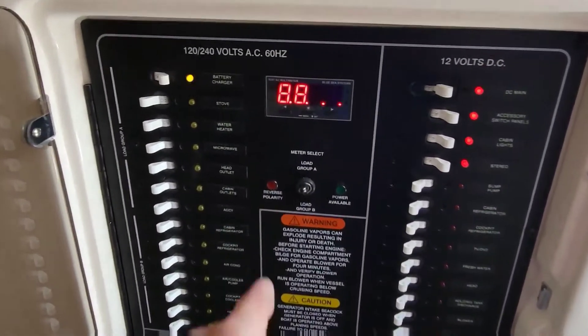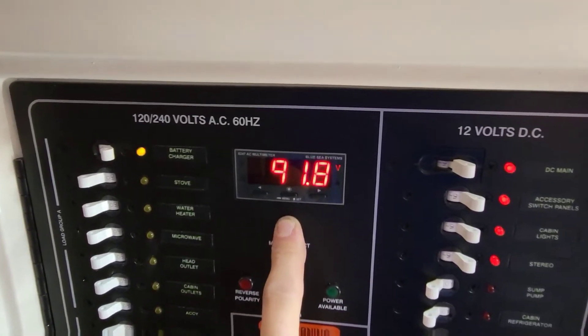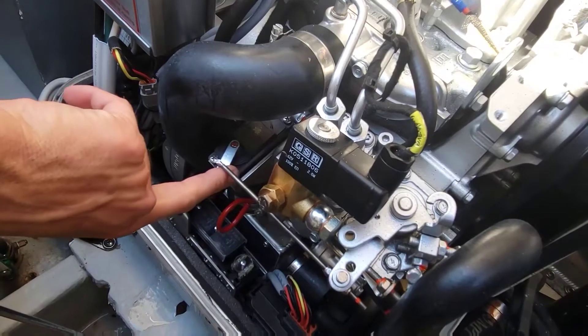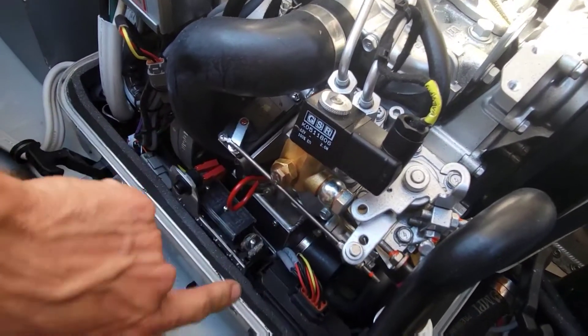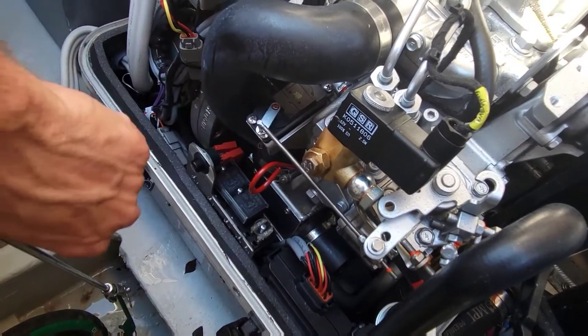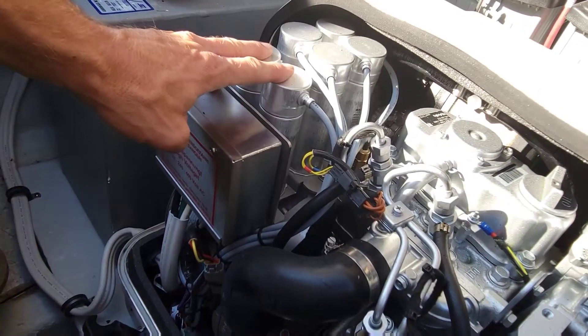Before I show you the generator, let me show you a quick clip of what it's actually doing. When it starts up, look at our voltage — it's only 90, 92 volts. As you can see in the video, this thing's only putting out a little over 90 volts. That's actually controlled by this arm right here, which controls your throttle. That throttle lever is controlled by this boost board down here, which is always looking for 120 volts, so it just varies the throttle depending on what load you have on it. It also controls these capacitors — it adds a couple of capacitors when you put a heavy load on it.